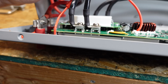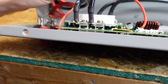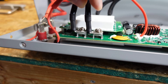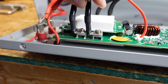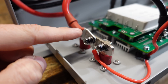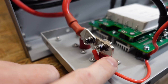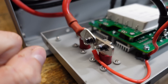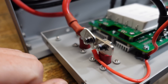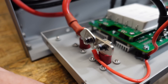On the BMS connections I do like to see that they are using 90 degree ring terminal lugs — this is something I've not seen on many other batteries. Typically the leads are bent when they come off the BMS, and I don't like seeing that. So I do think these 90 degree lugs are a great upgrade to help keep these wires from getting kinked and damaged when they exit the BMS. Taking a look at the terminal connections, we have both conductors coming into a single ring terminal terminated on a small bus bar, which is connecting both posts in the front together. I wish it were a little bit thicker; however, I don't recommend wiring these in the daisy chain approach anyway, so you should only really need one of the two terminals.